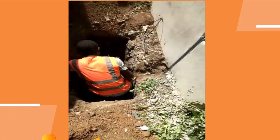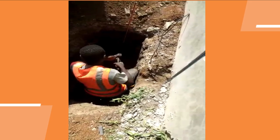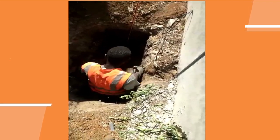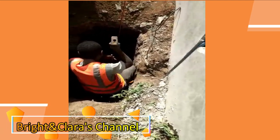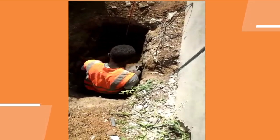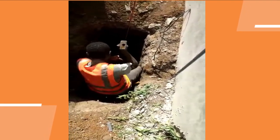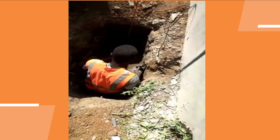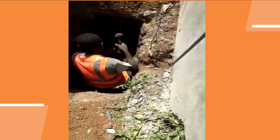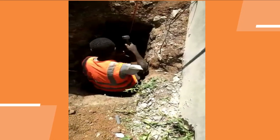So here we have to dig the ground and put four earth rods into the ground. He's hitting the hammer on the earth rod — he has to make sure this earth rod goes into the ground. This is a four-foot earth rod; we have two-foot and four-foot sizes. We put four earth rods together, spacing them about one meter apart, and then we loop them. The essence of this is to give you a low resistance value — we aim to obtain about zero ohms, ideally as close to zero as possible.